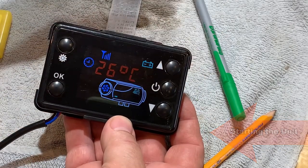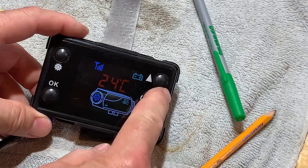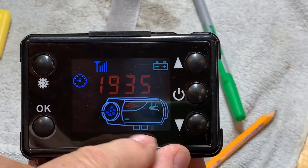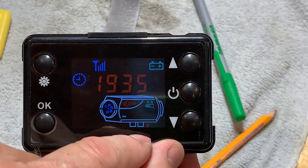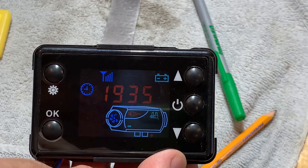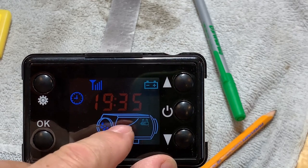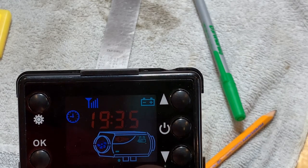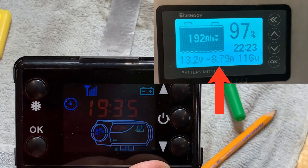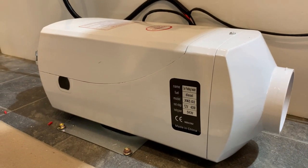Before I start it, I'm going to raise the temperature to 26, knowing that the current temperature is 24. To start it, we just touch this. You can see we've got air coming in, air going out, the fan is running. Over here you can see the glow plug is now going. The glow plug is needed in order to ignite the diesel. After the unit is up and running, the glow plug will go out and the diesel itself will keep itself lit. At that time the amps will drop significantly. I'm looking at the draw right now and I'm at eight amps and 111 watts. Let's just let this run for a little bit.